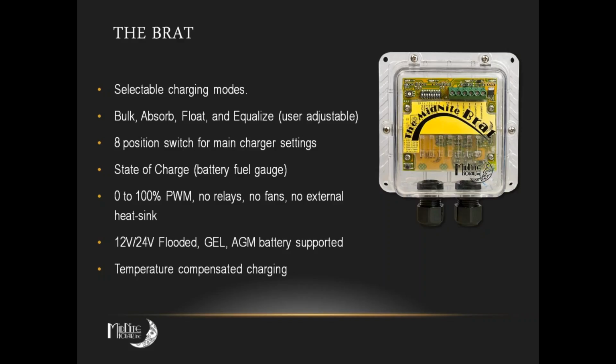Next question for you is, how does the AGS stop, assuming that's the AGS on the kit? I assume it stops on time and voltage, but maybe you can comment on that. That one I'm not entirely sure on. I haven't really messed around too much with the AGS. And is Rachel in the background by any chance? Or maybe Rachel knows. Well, anyway, yeah, I'm not really entirely sure on that. I don't think it's time. Well, I'm thinking it's got a max runtime, but I also think it probably... There is a max runtime. Yes, you're right. Probably has the ability to shut off at float or things like that.